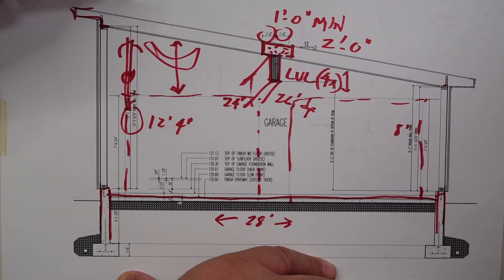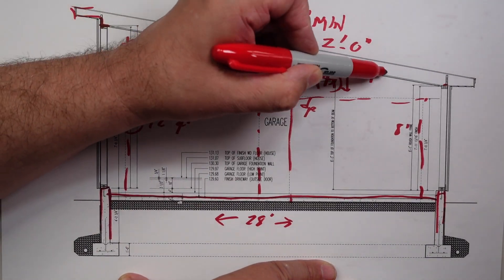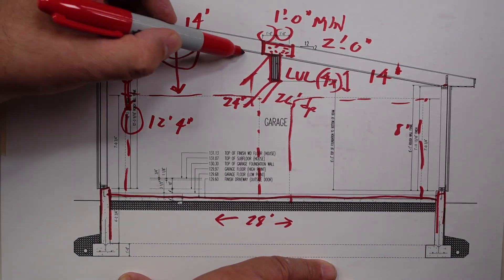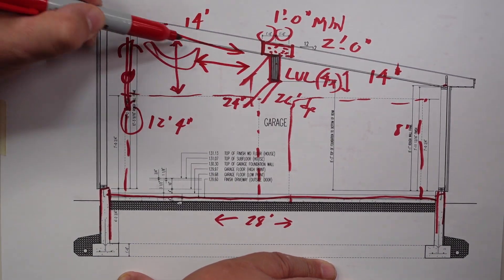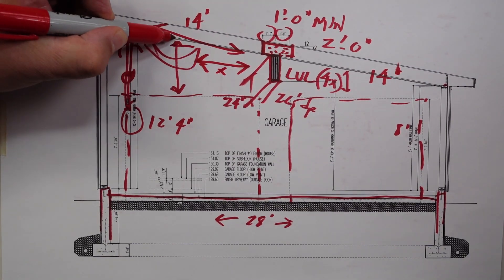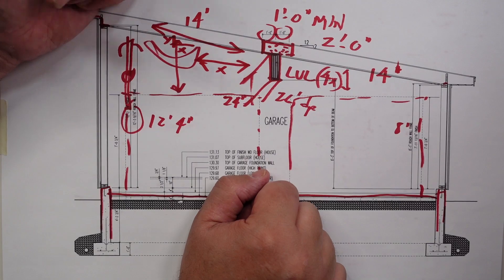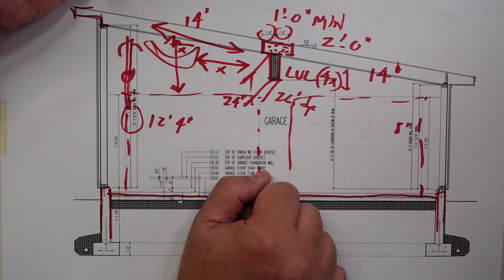And we have our eave there. But it's a very simple — at 28 feet, these are on the order of about 14 feet in span. And remember, when you're talking about span of rafters, it's not at the angle of the rafter — it is the horizontal projection. Because when you put it at an angle, the load actually ends up having an x and a y coordinate, very much like the slope of a roof. So anyways, you can see that's how we framed it. Really simple garage, but some simple framing and certainly nothing revolutionary here.